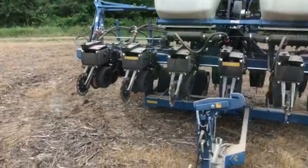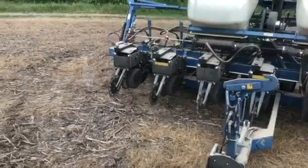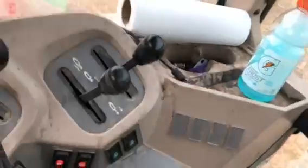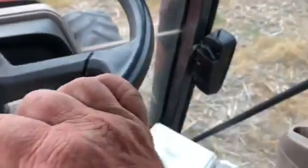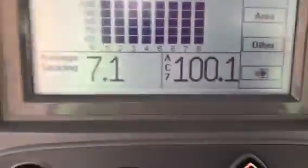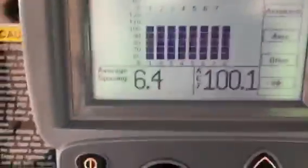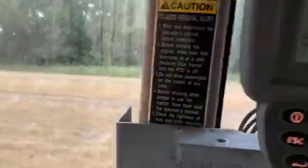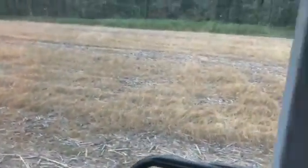Going down right now. I'm going to set it on the ground a little bit, pull up a few feet, and plant with this — make sure it works. There's the units working. I did 7.1 spacing, 6.14. Basically, I'm just planting to make sure and readjust everything. I did not turn my blower on — I figured there was enough seed in there to get the fan going.